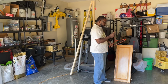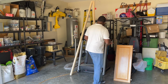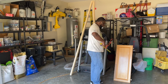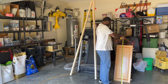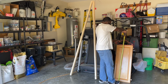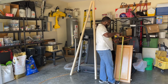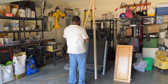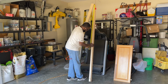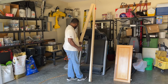So I need to accommodate for the length of the door plus the hanger to figure out where I'm going to put my first shelf. I don't know if I'm going to have enough room. This 2x4 is only, but this is more than 48. Yeah, that's more than 48. It's going to take about 51 inches for clearance. So I go the opposite way. I come down, let's just say 52 inches. We'll just make it 53. And then that's where I'll put my first row.